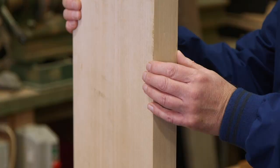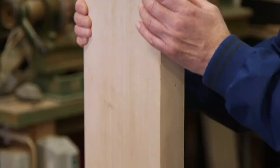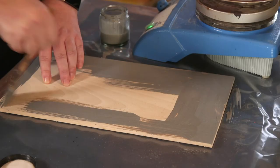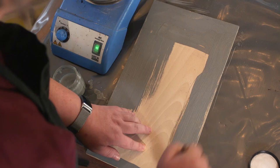What we have here is a typical lime wood board after the sap wood and the bark have been removed. It's about 300 millimetres in width. Lime wood was used because it was soft and carves easily, and has a fine straight grain with very few defects such as knots and shakes.